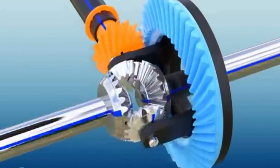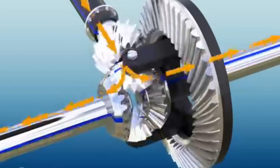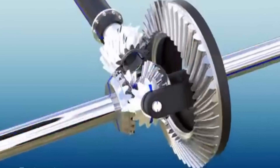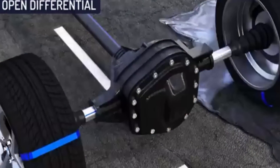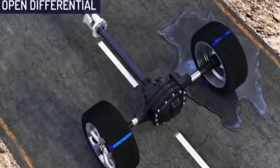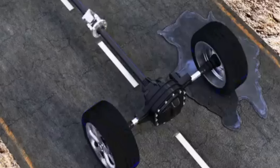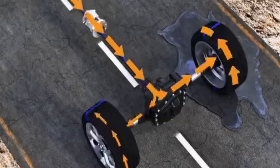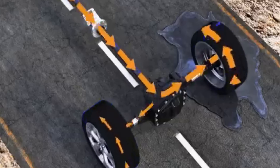The question then is: how do we do that? Think about the car differential. The job of a car differential is to take the power from the engine, turn it 90 degrees, and split it into two to drive each wheel. It can be reversed: if you drive each wheel, it combines those onto a single axle. It seems like a great answer, but a simple open differential has another issue — it's called slip. If one wheel is stuck and the other is free, the free wheel will spin like crazy with no drive on the stuck wheel. So if we tried to put that directly into the wind turbine, we'd have the same problem.